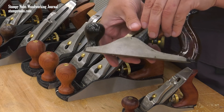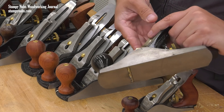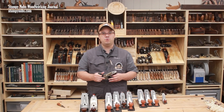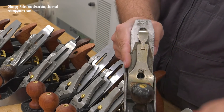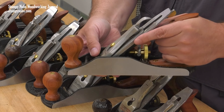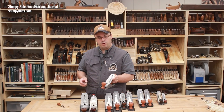The number two is slightly larger and slightly more useful. The grip is still too small for most adults, but it's comfortable for children, if you trust your little ankle biter with a relatively rare and expensive tool like this. Of course, it wasn't just made for children — this was marketed as a smoothing plane for smoothing small areas of difficult grain, but I don't know anyone who uses one of these very often. Everything changes with the number three. Like the number two, this one is for smoothing surfaces, particularly those with grain that changes direction. A small plane may be maneuvered around to avoid going against that grain.